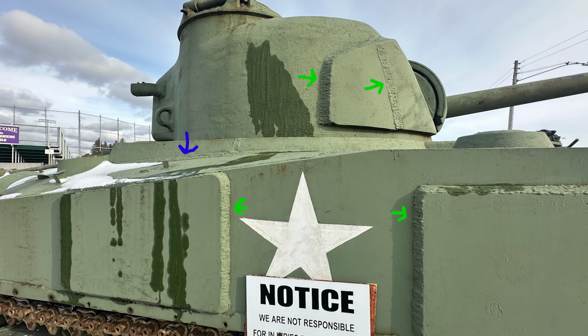That's definitely not wire welds, and wire that was high chromium, high nickel didn't even likely exist for self-shielded flux core back in the early 40s or so, so definitely stick welding there for the gangster passes. Anyways, that top turret appears to be a one-piece casting. It wouldn't have been a forging, but a big casting, and I'll tell you what, that armor plate on the side there, that's pretty thick stuff.